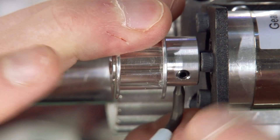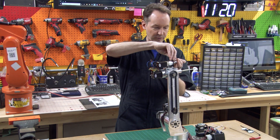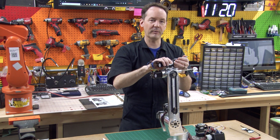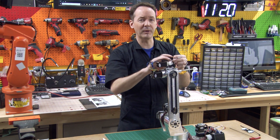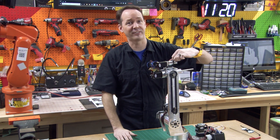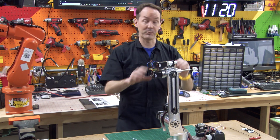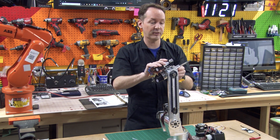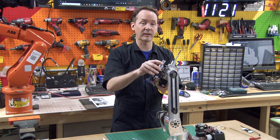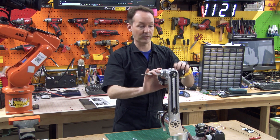You've got a very fine thread on a steel bolt going into a piece of aluminum. When they talk about space-age aluminum, that's like one step away from dirt — remember the space age was in the 60s, it's been 60 years since then. Aluminum is great to work with, it's light and easy to machine, but it's not ridiculously strong and it's very easy to strip out threads. So finger tight plus a quarter turn — that's all you get.